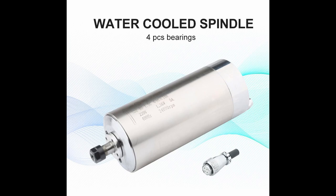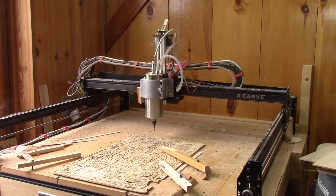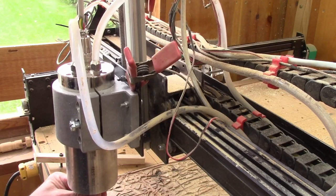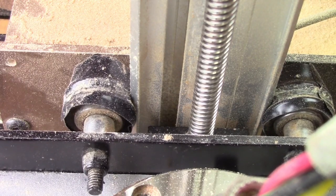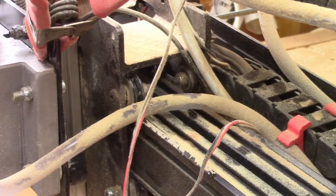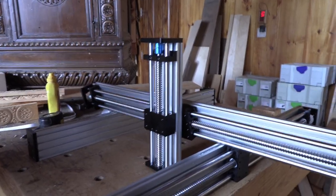Following this, he decided to acquire a 1.5 kilowatt three-phase water-cooled spindle motor in order to upgrade an already overworked machine. Then more problems started to show up: this motor weighs much more than semi-pro duty routers. The extra weight rapidly took a toll on the lighter structure of his CNC rig, heavily taxing the Z-axis mechanism. As you can see in the video, the rubber belts gave up regularly. Those belts were replaced by small lead screws, which quickly wore out causing intense vibrations and intolerable backlash.